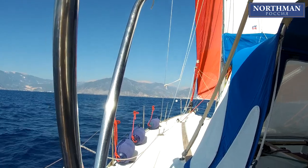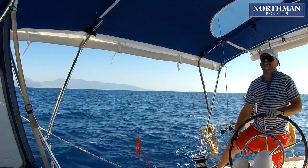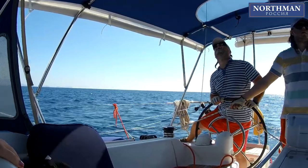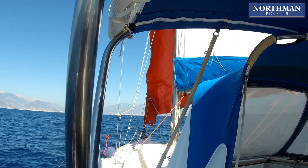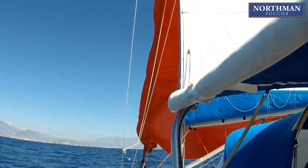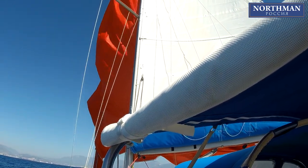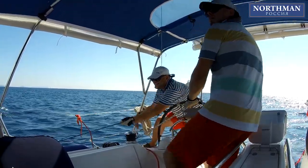As the sail is free, you can turn to the wind as much as you need to fill the sail. Every time you furl the sail it will be slightly different — you will need to gradually develop a personal technique of depowering your chute. If you have a masthead asymmetrical spinnaker, as we do, some wind will remain in it even on a deep run. You will very likely have to ease the sheet all the way so that the sail would flag forward for easier furling.